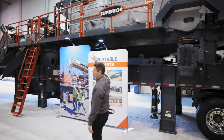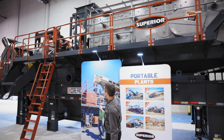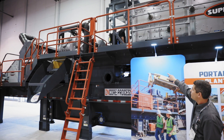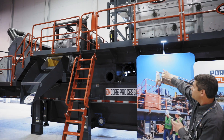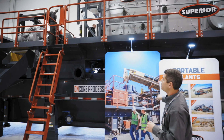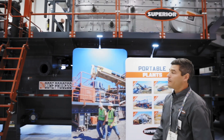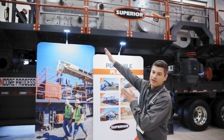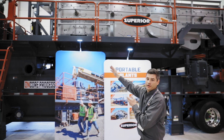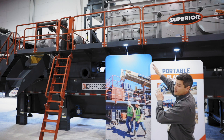All the feed for this whole plant comes in on the slurry hopper of the screen. To go from operation to transport position, you hydraulically raise and lower with the hand levers to get that from transport to operation position. When you come in and set this plant up, you'll feed your materials in there. You can do dry material, or you can feed directly from a dredge if you put a dredge feed box on top.